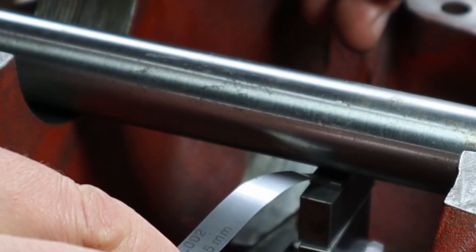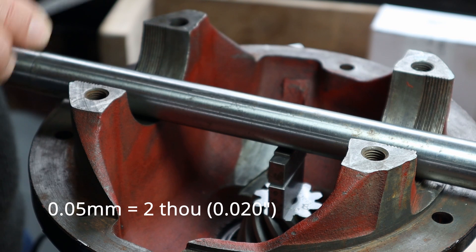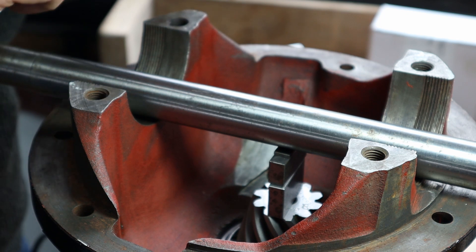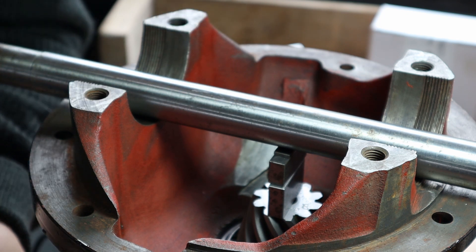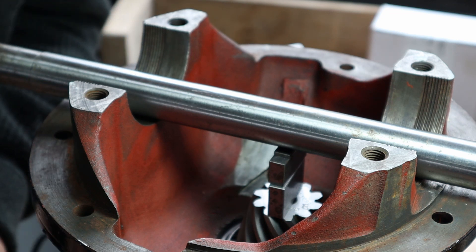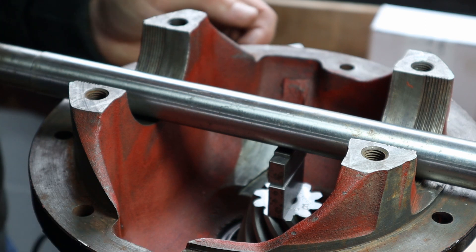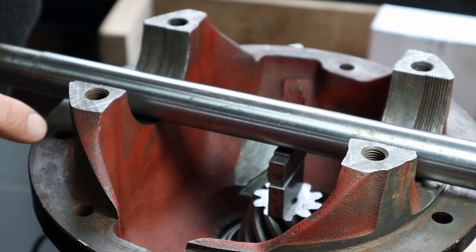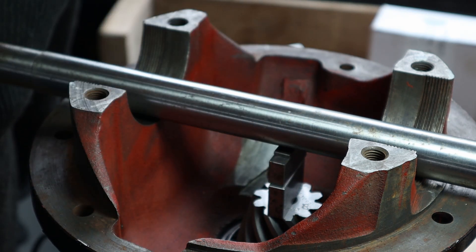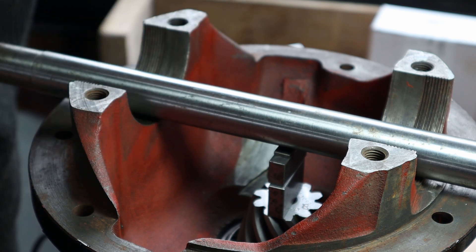I'm going to use some feeler gauges to measure that gap by placing the feeler gauge in there. This one is 0.05 millimeters. If the feeler gauge won't go in, we know that the gap between the bottom of this bar and the top of this stack of slips is smaller than 0.05 millimeters, so we're within tolerance. That happens to be the smallest feeler gauge I've got, so I'm going to go with that — we are within tolerance for what I'm building here. Obviously if you measure this gap to be 0.2 millimeters, you need to take that bearing shell back out and put a 0.2 shim in, put your bearing shell back in, and re-measure to check it's correct.